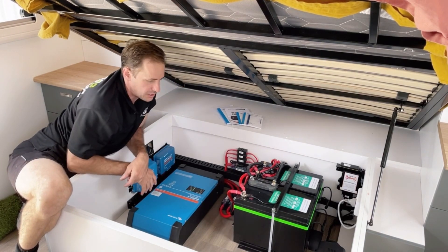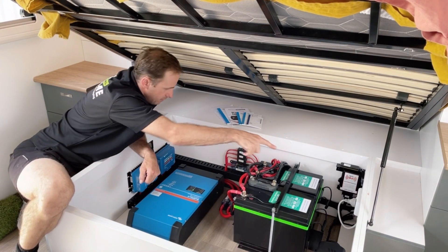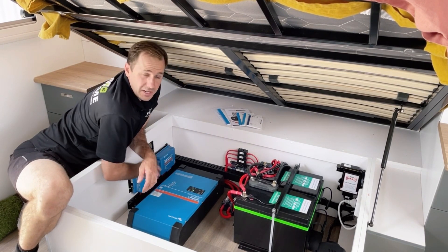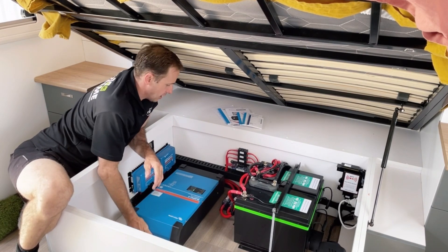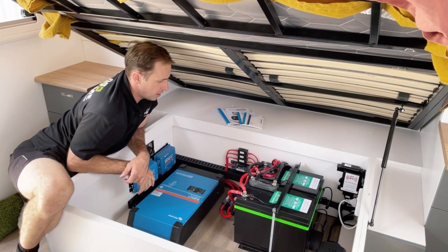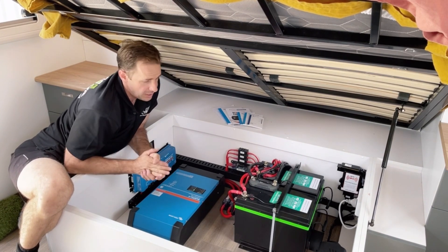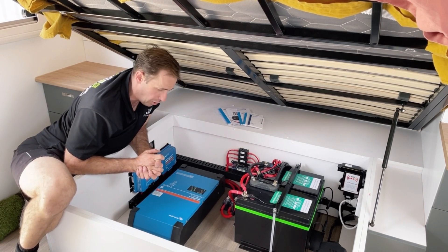They can build a division around here so they can still utilize this front section. Plenty of cross ventilation here, vents on this side. Got a ball bearing fan there pulling air from the top of the controllers out - these are the things that are going to get warmest because they're always on. The inverter charger will barely ramp up, but it's got a convection fan that will pull air through and shoot out through the side. I've had this running most of the day and the temperature only went up about three or four degrees under full load.